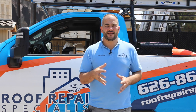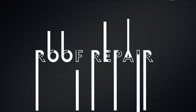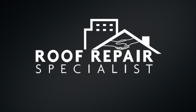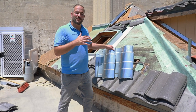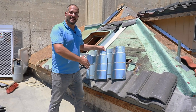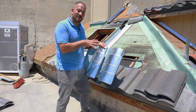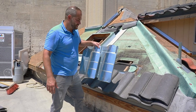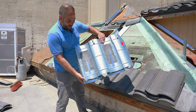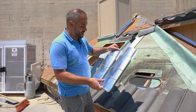In this video, I'm going to show you how to install an O'Hagan vent for your S-shaped tile roof to match the profile of the roof and properly vent your roof space. This vent is manufactured by O'Hagan. There are a few different manufacturers, and more or less they're roughly the same thing. The idea behind these vents is that it matches the profile of the S-tile itself. Now, this is pretty universal — most S-tiles it'll work on, but just make sure that you try it out before you actually install it. We like the ones from O'Hagan. They have a few nice features. Number one is that they have a great screen for birds and bugs, as well as the base flashing.